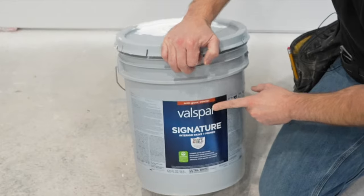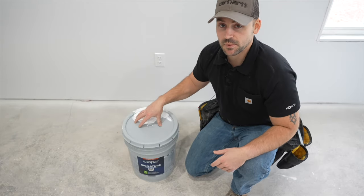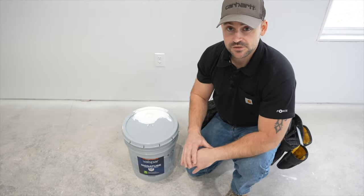The window I'm going to show you how to trim out is a standard five-foot-tall window that's three feet wide, and no matter the dimensions, the techniques can be customized. I'm using a three-and-a-quarter colonial trim. There are a bunch of ways to trim out windows — this is just the way I prefer because it's a very simple method yet it looks really good. The first thing we need to do is paint this trim because it comes primed. The paint I'm using is Valspar Signature, ultra white, semi-gloss — I always paint my walls satin and all my trim accents with semi-gloss. It gives the trim a nice sheen.